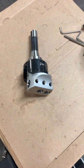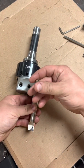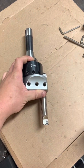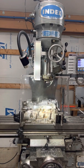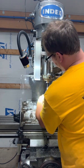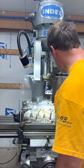Now we'll install this. There's a simple set screw on here — you'll notice there's a little flat. Slide this into the hole, rotate the boring bar a little bit as you tighten that screw, and you'll feel it hit home. Give it a good snug — you don't have to kill it, just don't want it coming loose. Before popping anything in the mill, I always like to blow off the shank — make sure nothing's on it because it can throw things out of whack. These R8 shanks have a little keyway that you've got to line up. Janky power drawbar I made out of a cannibalized impact — works, it's crude and janky, but it works.